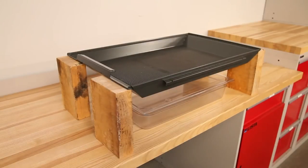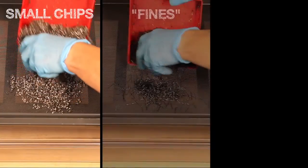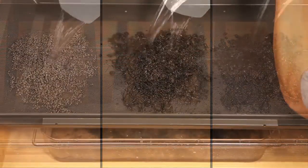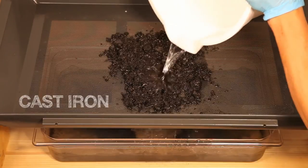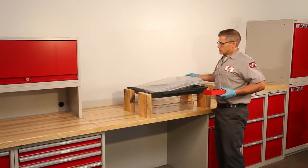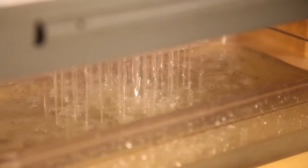Sometimes really fine chips or sediment-like contamination can reach your tank. The perforations on the coolant inlet panel are very small and do an excellent job of retaining even fine chips. Even with a pile of fines sitting directly over the inlet area with coolant passing over them, only a small fraction of the chips make it into the pan. Despite this, over the span of many weeks — if the chips are extremely small or you are machining something like cast iron where the chips form a grit-like substance — a larger quantity of chips can gradually build up in your coolant tank. In this case, you should consider using a chip strainer like the ones that come with your new Haas machine. Stretched over the supplied chip basket and placed above the inlet panel, it allows coolant to pass through while keeping chips from entering the tank.